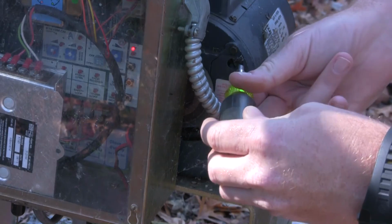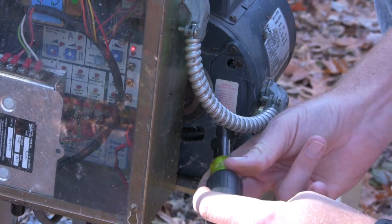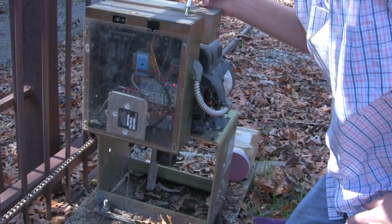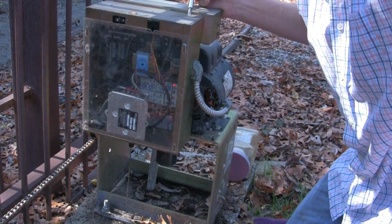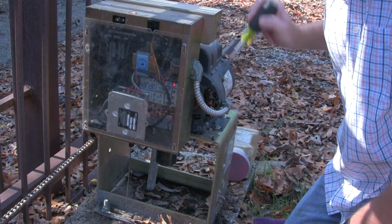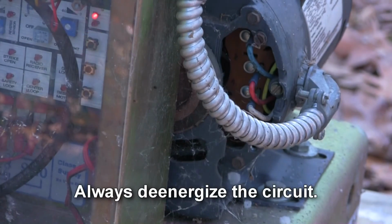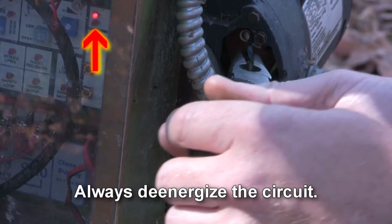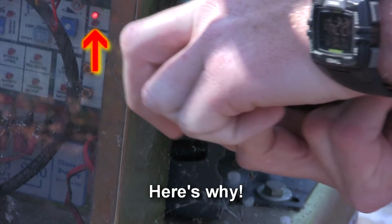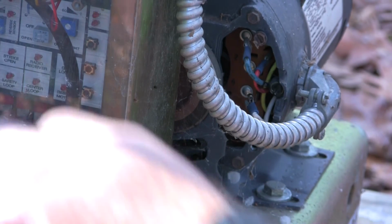I'm going to take the plate off. That will expose the lugs to the clockwise, counterclockwise, and neutral of the motor. On top of the housing right here, you probably barely see that, I have written down the coloring of the wires from top to bottom. So it happens to be blue, red, white, and I've got BRW marked on here. So I'm going to go ahead and take the wires off, just with some needle nose pliers.